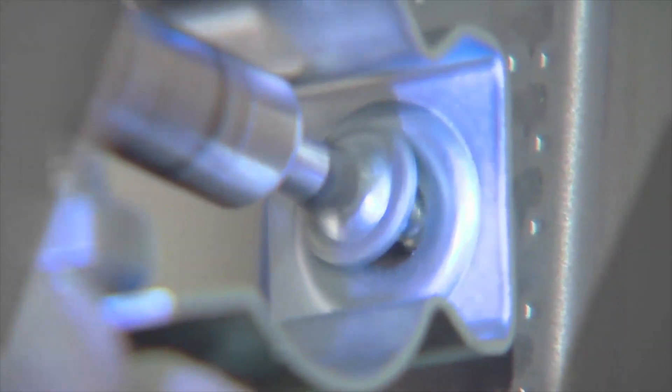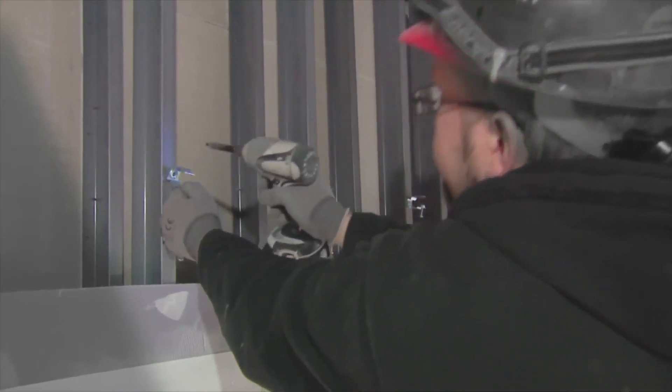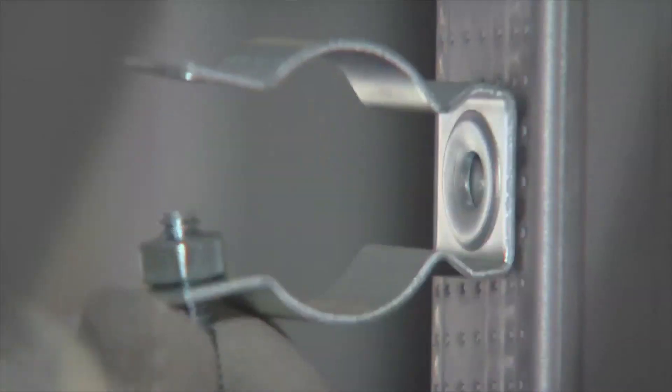You press a little harder, push a little more, but on each cam-out, with each slip off the screw head, bad bits get gnarled and cause damage. Usually when a bit's going bad, the tip gets chewed up around the corners, doesn't hold the screw well, screws fall out, it wobbles, skips when you're trying to drive the screw in.